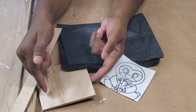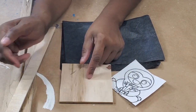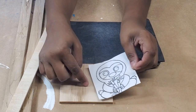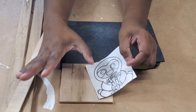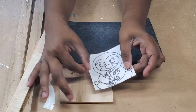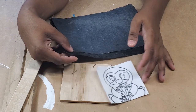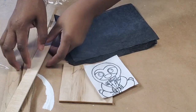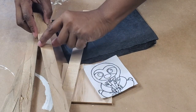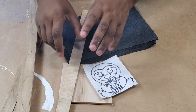I have here a quarter-inch piece of plywood — quarter-inch thick — and I have my template here. This is a sloth. I'm going to trace it onto here, keeping it minimalistic just for the shape at first, and then I'll trace in more detail after we get it cut out. I'm using a piece of carbon paper to get the shape onto this piece of wood. I also have a few strips of plywood, quarter-inch, cut in one-inch wide strips. I don't need all of it — I cut extra just in case I make more of these, which I probably will.